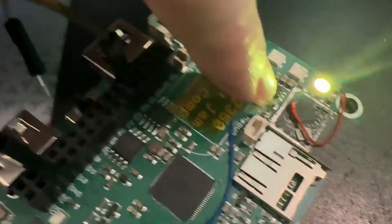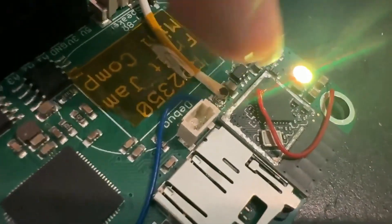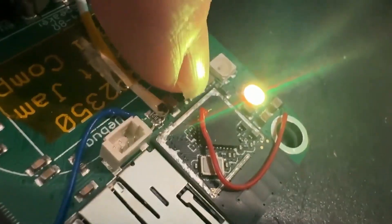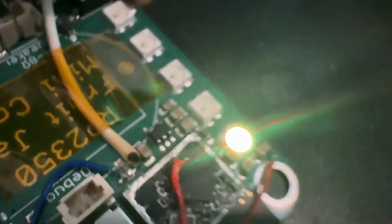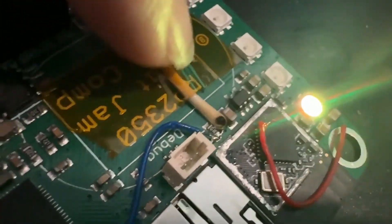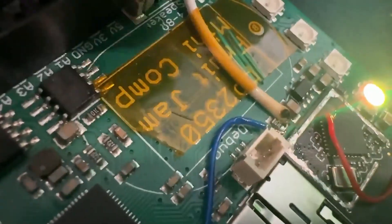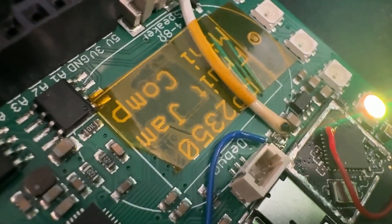If you're wondering about this red wire — to do the download you have to pull IO8 up, and I didn't realize that. So I had to uncap the module and solder to this little pin here. You only have to do it when you're first uploading. I also didn't connect this wire by accident, and there's a couple things going on with this IRQ pin. But that's what revisions are all about.